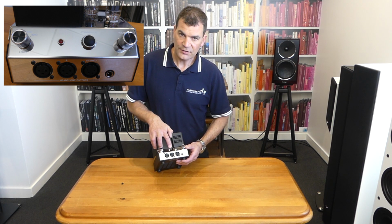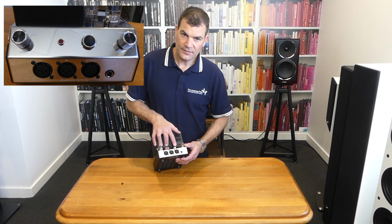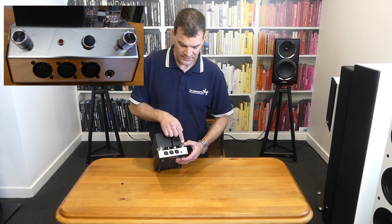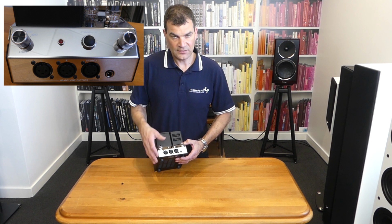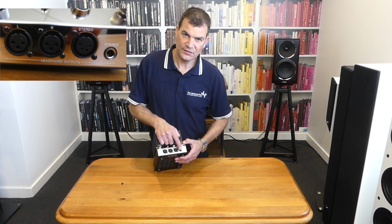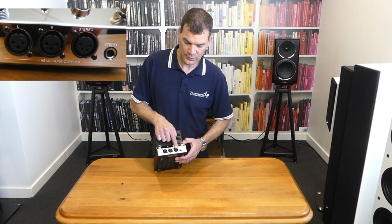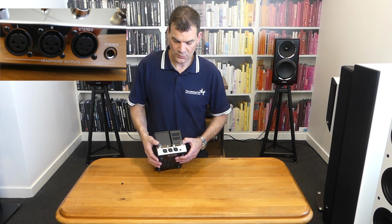It's got a standby and power light that glows, and a standby on and off button that's a tap. Then of course the last knob is the volume control. It has a neat little wee click in the middle giving you a centre point, and that's part of attenuating the load. Then we've got its output. Now it has a 6 1/4 stereo output, and of course with an adapter it'll run your 3.5 mils. Beside it is a stereo balanced output, and then a twin left and right balance depending on how high end you end up with your headphones.